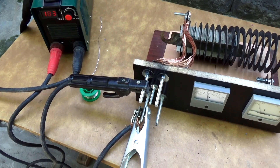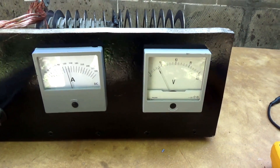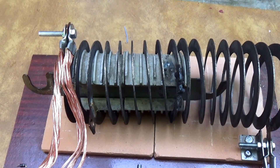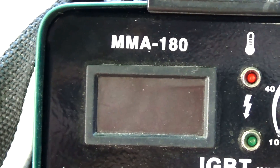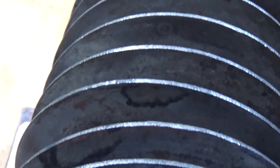When connected to a welding inverter, our test bench turns into a very powerful heater since all the power is turned into heat on the ballast resistance. For example, if the inverter produces 100 amperes, taking into account the voltage, this is already 2 kW of heat. The ballast will of course warm up, and in the future I may add a powerful fan.